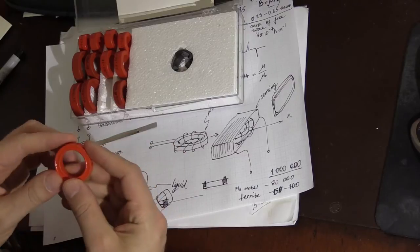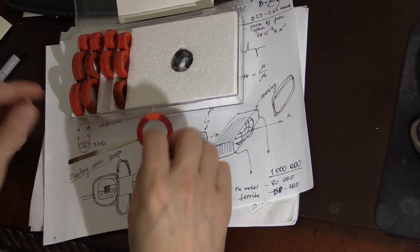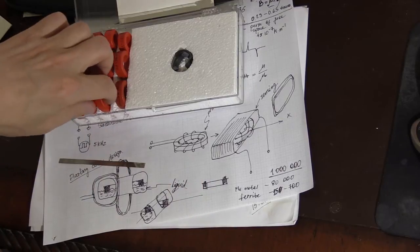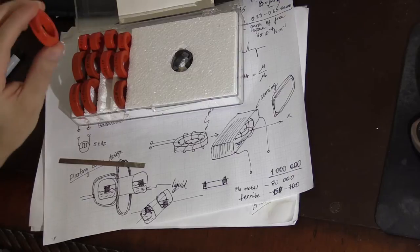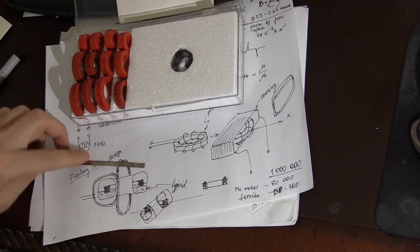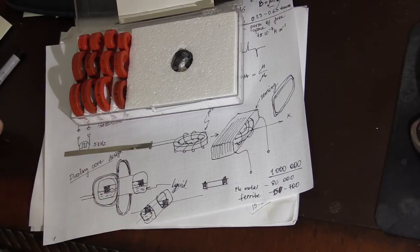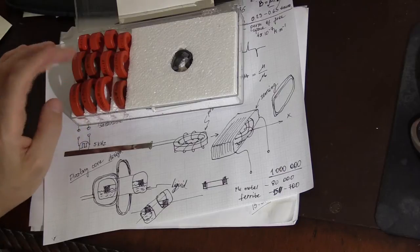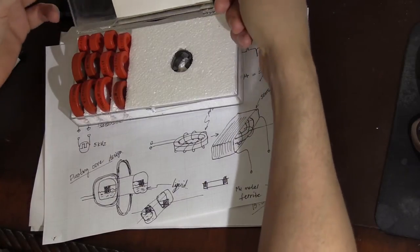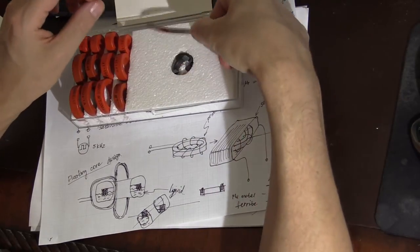Since the core is painted I can't see inside easily, but last time I tried to measure the permeability of the Metglass used in this specific core, it didn't turn out to be the most permeable. There are a number of alloys all called Metglass because it's a brand name, but not all of them have very high permeability properties.